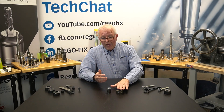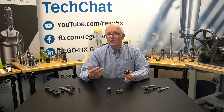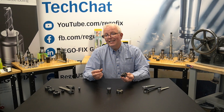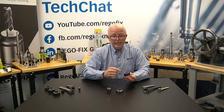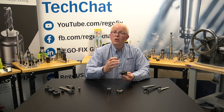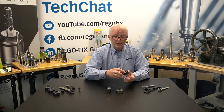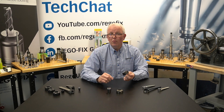We didn't just stop there. After the regular UM nut came out and before the Hi-Q nut came out, we invented the very first friction bearing style nut. There are no ball bearings in this. In a lot of the nuts you see in today's industry, you will see they have ball bearings inside of them. They work great initially, but those balls tend to get flat spots on them and you start losing clamping force — you can feel it when you're tightening the nut. The friction bearing nut, in this case the GM nut, actually has a metal ring on the inside that is precision fit into the outside body, which is chemically treated. That provided a low friction area and allowed us to transfer the friction from the outside of the collet to the inside of the nut for higher clamping forces. This nut over the old UM style provided about a 200% increase in clamping force — it was a very big improvement.